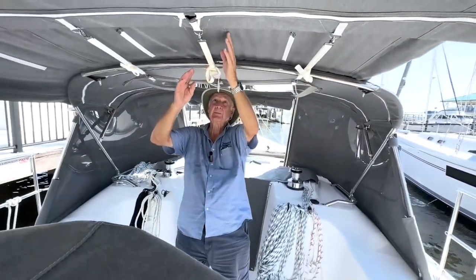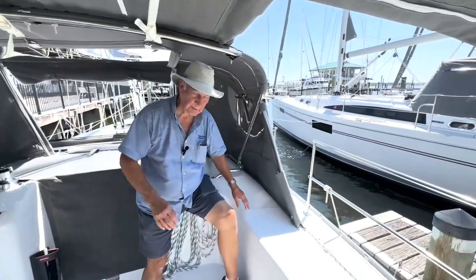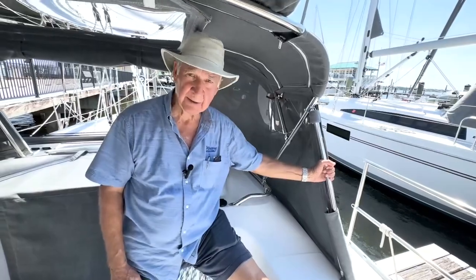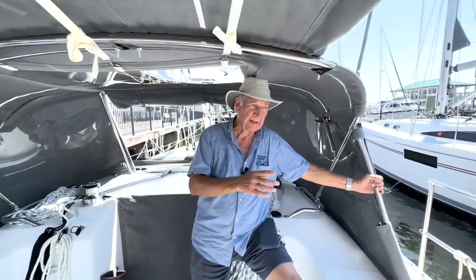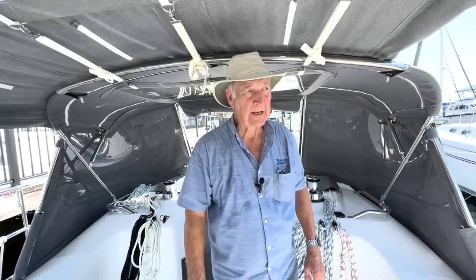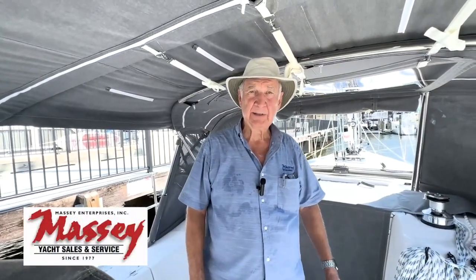Now I don't have to bend down at all to come into the cockpit — that's position one. If we took it to position two, this would come to right here, same on the other side, and we'd have full visibility of our mainsail. We also put a zipper down low on this panel so it can't just flop around — it's captured up here and down here, and there's your handhold. On the 355, 315, and 385, our standard tubing is one inch here, one inch here, and one and a quarter inch as you go out. With that one and a quarter inch tubing, if solar panels wanted to go on this boat, we can build the frames and put the panels right up with no other alterations. There's a nice crown in the tubing and frames that keeps water flowing off the boat well. That pretty much wraps up our walkthrough of the interior and exterior of the Catalina 355. Thank you for watching and hope to see you soon in another video.